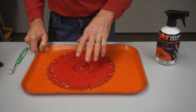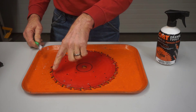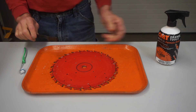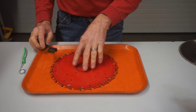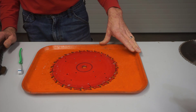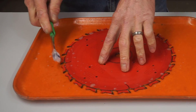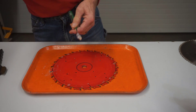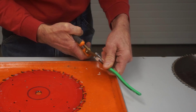Break time is over, so it's time for step two: scrubbing. I flip the blade over because the bottom side got more soaking time, so I scrub that side first. I start scrubbing using a toothbrush. Others recommend a brass or stainless steel brush, which is fine for a bare metal blade, but not for a Teflon-coated blade. From experience, a metal brush is only necessary for inadequate cleaner or soaking time. You might say toothbrush bristles aren't stiff enough — and I agree, they're a little soft. So here's pro tip number two: trim the toothbrush bristles back with shop snips to about half their length, and you'll double their scrubbing effectiveness.